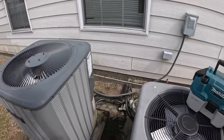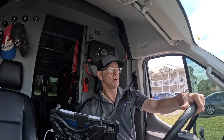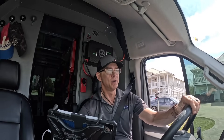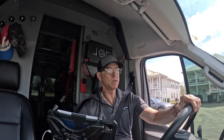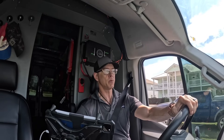Not hot. I'm not gonna check pressures on this one. Well guys, that was simple — just clear the drain. Sometimes that vacuum is all it takes to clear the drain, but this time I had to blow it out.